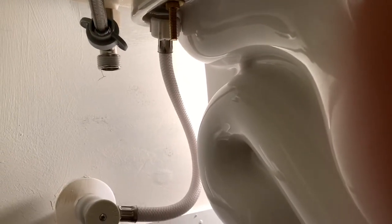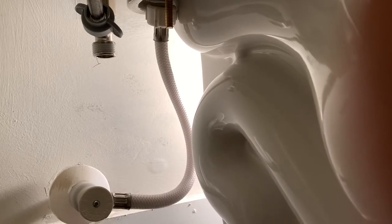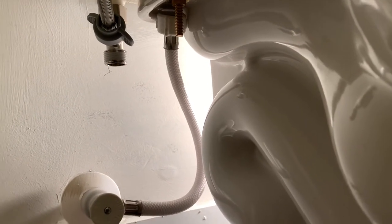In addition, this bottom hose was spraying water out everywhere when I was trying to connect it. So double check and make sure that you only have one rubber washer — not two. All right YouTube, good luck!